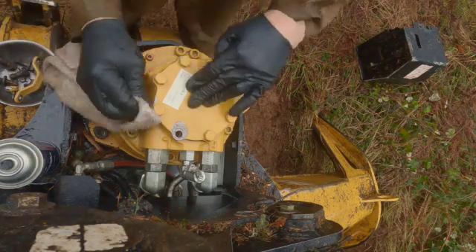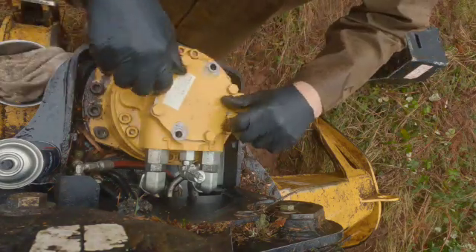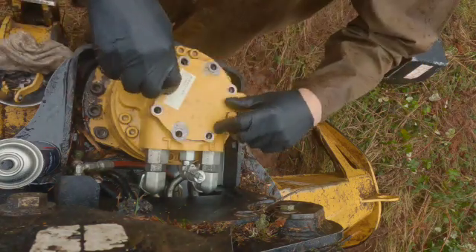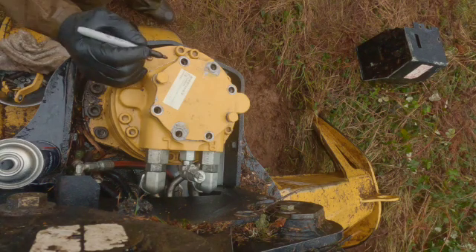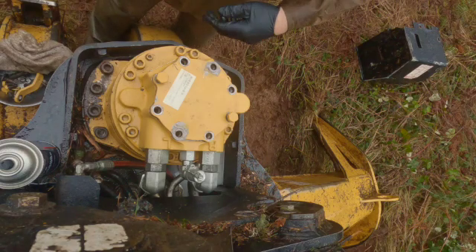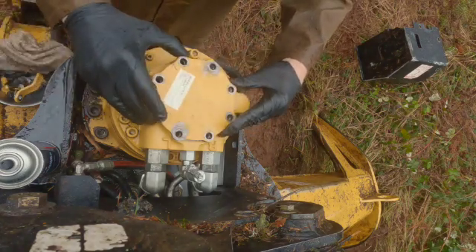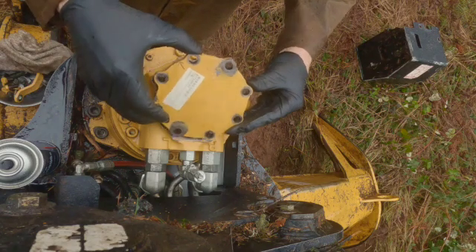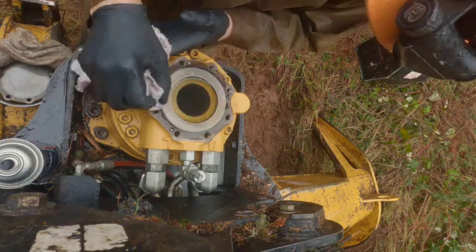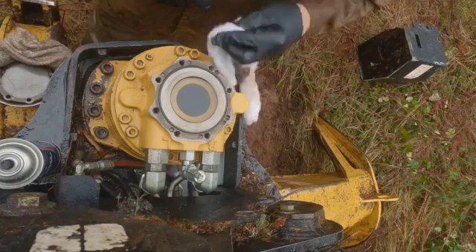When I get the bolts out, you'll see that the vacuum on the system is actually holding that plate — there's a little bit of suction on it. It points out what a good job this does. Often on a project like this, removing your hydraulic lines to cap and plug them can be the worst part. There's number-12 hard lines into 90s — difficult fittings to do in place. You can see that suction, and without pulling those lines you'd be blowing out serious fluid from the pressure in the lines up the stick, gushing oil out the distributor. The motor has six springs in it that would be blowing out too — this is just a nice clean setup.